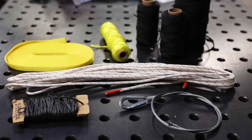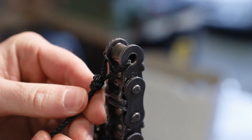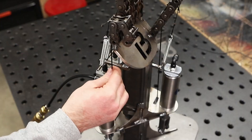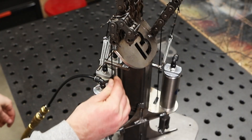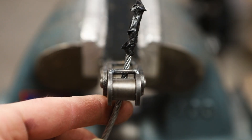Just like the elastic, I bought many types of cords and cables to try for the tendons. I used a nylon cord for a bit, but the hand turned out to be pretty weak. I think the reason is the cord was stretching — when I pull up on the finger, the cylinder doesn't move, but the cord stretches. I tried using steel cable, but it was too big to route inside the finger under the bars.